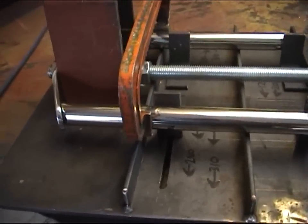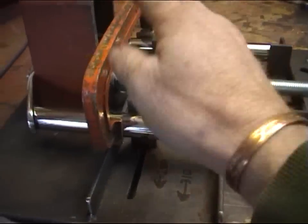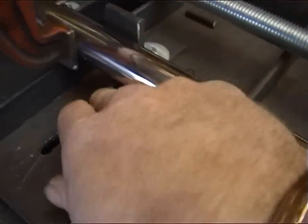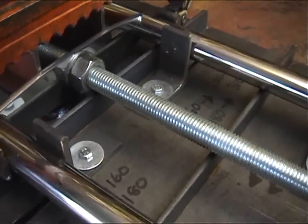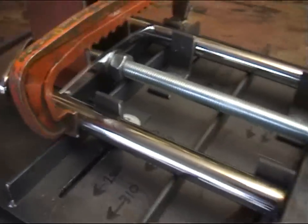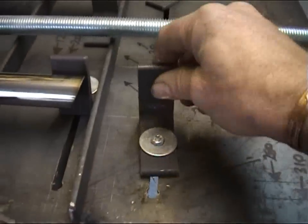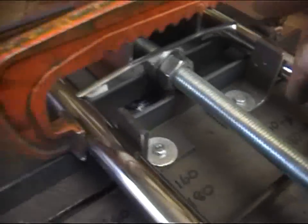It's set up. We've got three bars on here, 25 by 6, and the fork legs sit on these bars. That keeps them dead level. Inside here, I've got some adjustable clamps. These slide in and out of these slots, and I use them for various fork widths. I can basically make any type of fork on this jig. For the Bigfoot forks you need longer fork legs, so that's what these ones here are for. They can be turned round and adjusted. The scribed marks all over here are for the different fork widths that I use.